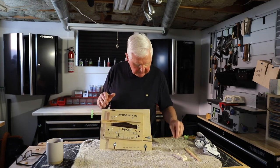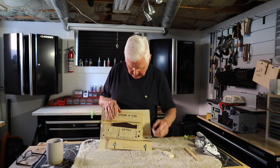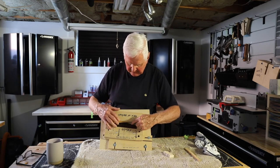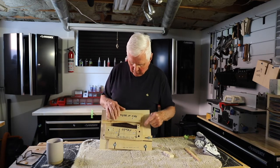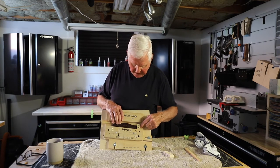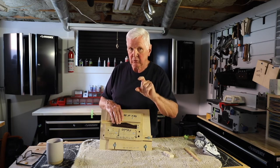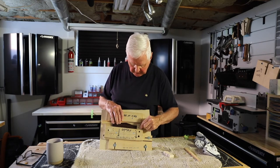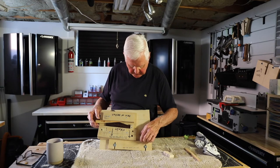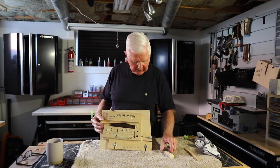My mentor is the one who actually came up with this idea. You draw a line across the 70 millimeters, come in six, draw another line, and that's where we start with the high treble E. We drill that right through — in a video or two we're going to be bolting this on to the top of the guitar and I'll show you how we glue it up. When I come to the next string, the B string, I put that spacer in and it's 57 — perfect.